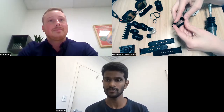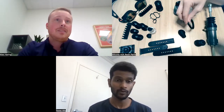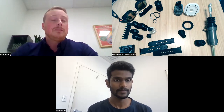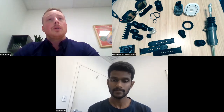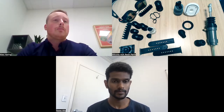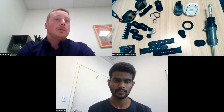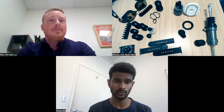Alex, the material is super impressive with a wide variety of applications. Can you tell us a little bit more about the workflow — what are the requirements for printing with silicone? It's not too different than what people are used to if they're already in the Formlabs system. You use a Form 3 printer — no special tank or anything like that. When your print comes off, you use a Form Wash just like you typically would, except instead of 100% IPA, you use 80% IPA with 20% butyl acetate, which helps dissolve more of the silicone. Following that, there's a 60-minute drying time, and then you cure it in a Form Cure — the only difference being you submerge the part in water prior to curing and it remains in water during the cure. After that, it's ready to go. There's no extensive long-term curing and no additional equipment needed. That sounds like the very streamlined workflow I'm used to with Formlabs printers.